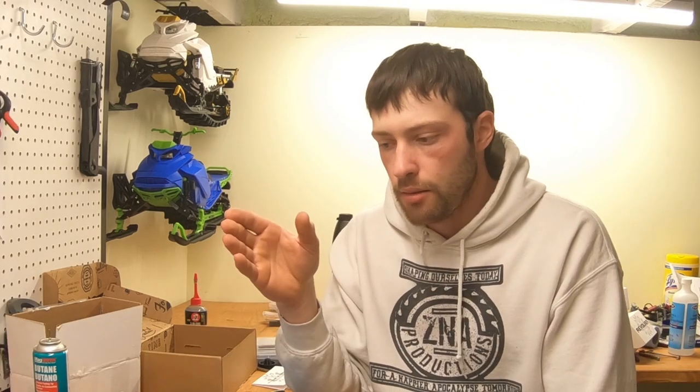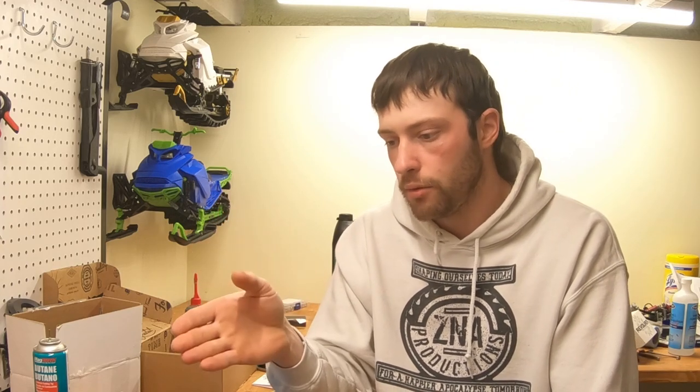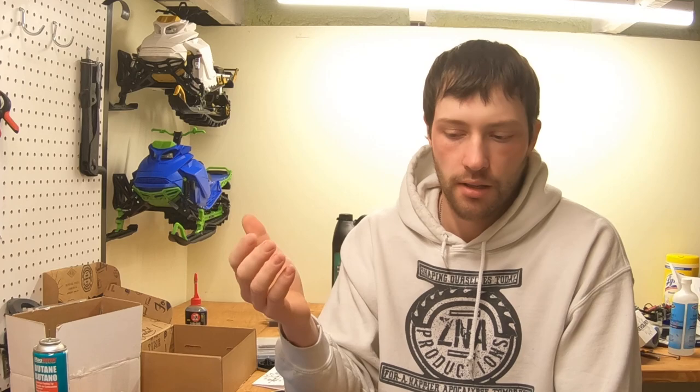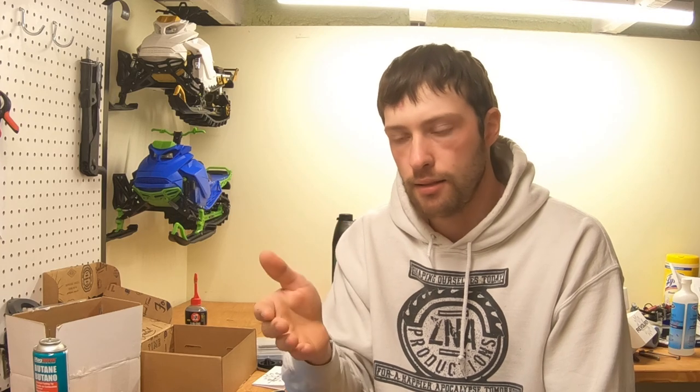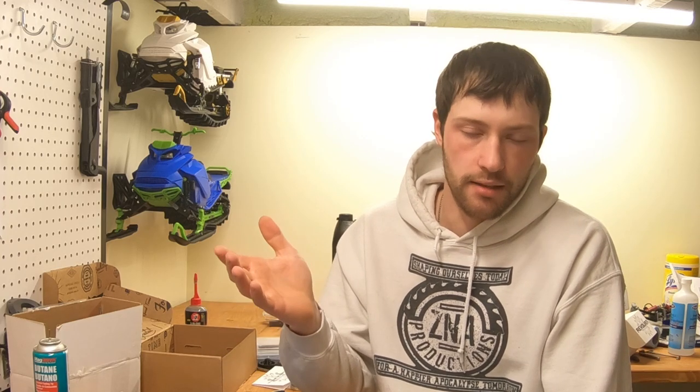I do think that the 0.21 engine that's inside of this is more than sufficient to do the job of a RC snowmobile. Of course, you can go big bore, but I think that 0.21 is sort of like the minimum requirement to have a nice experience. I would really like to see a two-speed transmission for these things because it takes a little bit of effort to get into some speed. If you only have one speed, you either have very low end, or it really doesn't go very fast. If it had a two-speed transmission, it would solve these issues because you can have more low end and more high end. Also, before you ask, a CVT transmission is pretty difficult to do at that size, so I guess that's why it's never been done before.